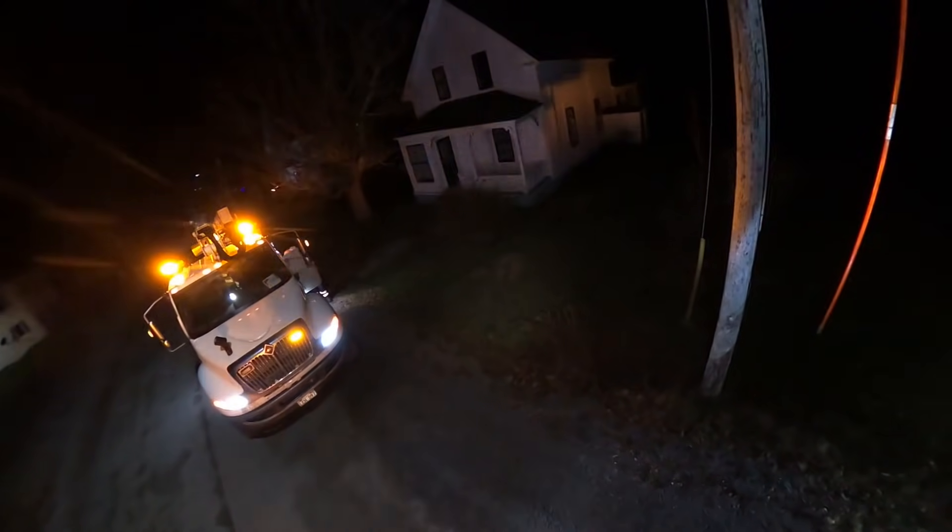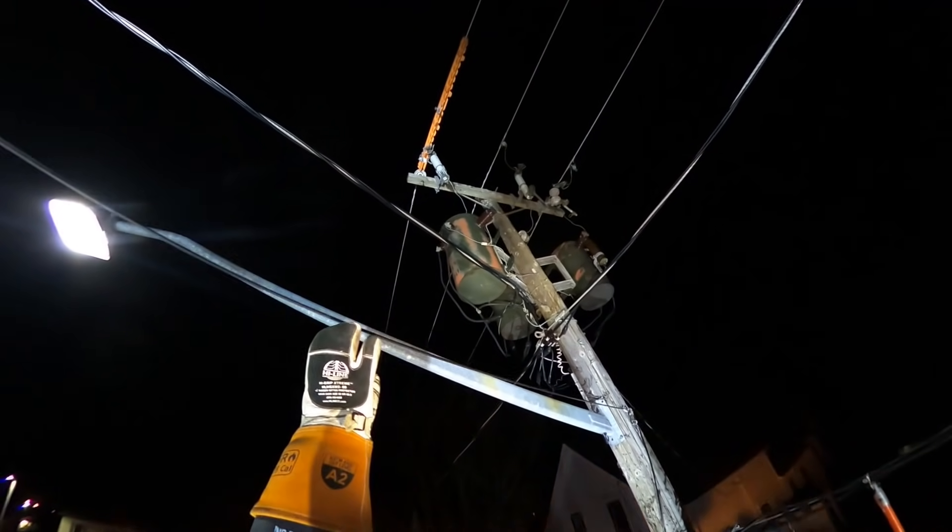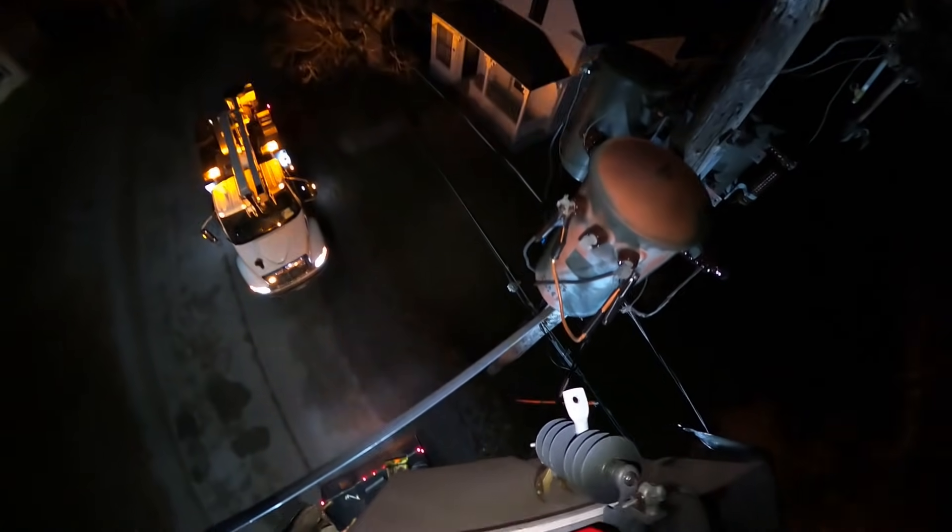If we're changing the tap clamp and it's just on a transformer, we don't generally need a work permit for that. There are some situations with parallel transformers or back-feed customers on equipment where it might get a little more complicated. Generally speaking, we just open the transformer. One thing you do have to look out for in the transformer situation is back-feed from customers — everyone's got a generator nowadays. You can do one of two things: because chances are you're going to be touching that lead coming out of the high side of the transformer. First thing you can do is remove all the meters so there's no back-feed — that might be a pretty big pain if it's feeding 16 houses. So we actually have written into our procedures that we can check for potential and install grounds on the secondary bushings of the transformer.